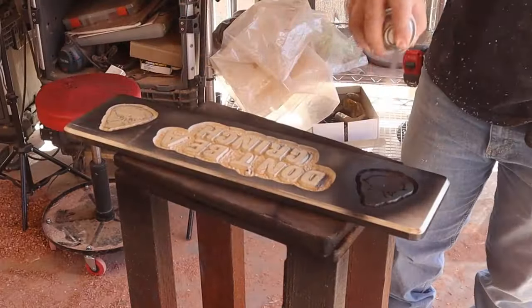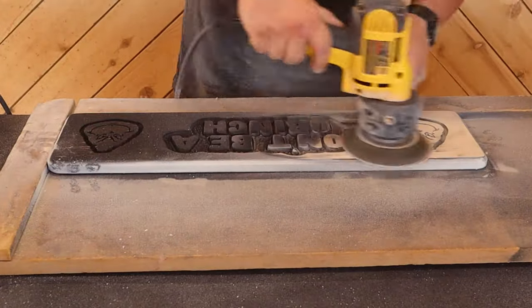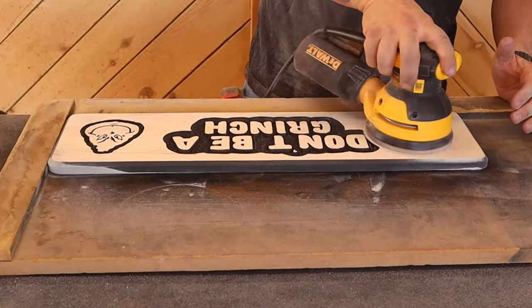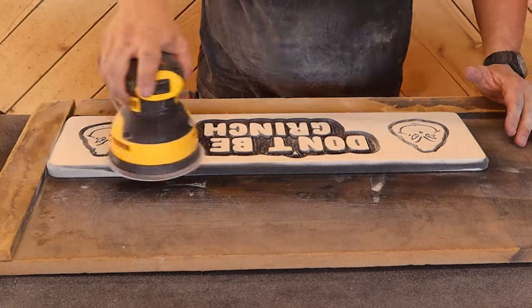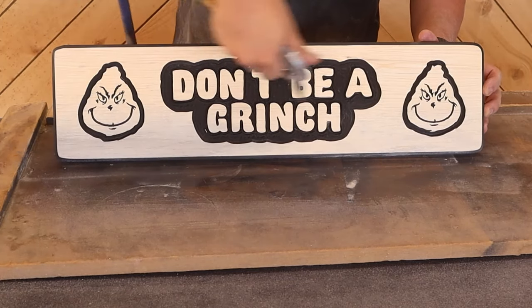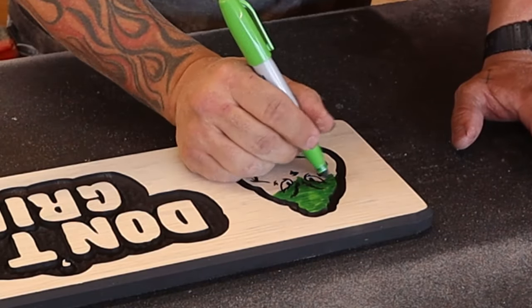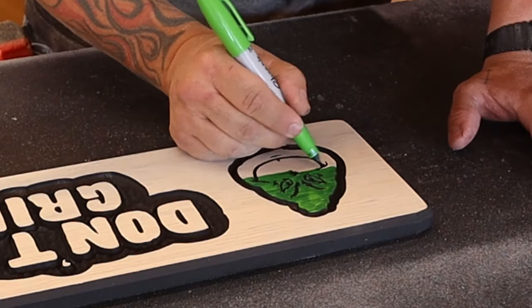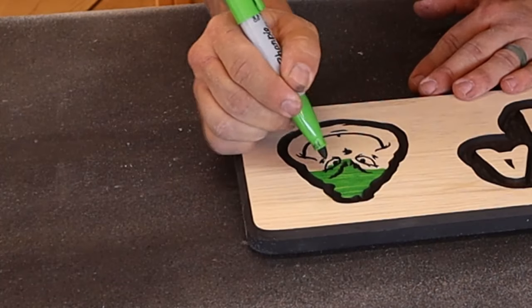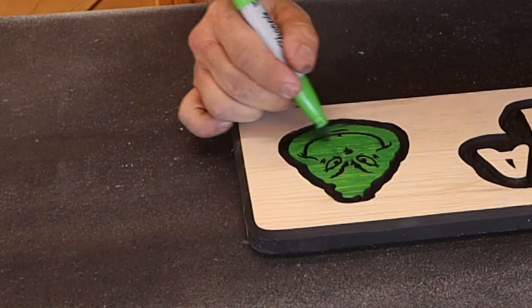Now I'm going to use our black primer and I'm going to spray everything black. This is pine, so you want to be careful not to over spray. You don't want any puddling, but you want to get everything down there nice and dark so you can see the contrast. Once it dries, which only takes a couple of minutes, then I'm going to sand it off with an 80 grit disc on the disc sander and 120 grit disc on the random orbital, and I make sure to blow it off in between each one of those sanding processes to keep from grinding sawdust back into my board. Now I'm using a green Sharpie to color this sign. If you're going to do that, it does last a while, especially if it's an indoor sign, but make sure you do it before you do your finish. That way it can soak into the board and the finish will actually protect that color and keep it looking good for usually a couple of years indoors.